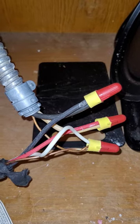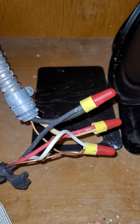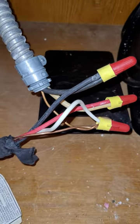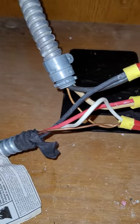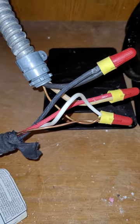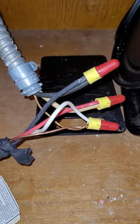So in this case, the black wire from the circuit breaker box and the white from the circuit breaker box are both hot. And then finally, the white coming from the cooktop is not hot, and that got connected to the ground connection. And that's the end of the story.